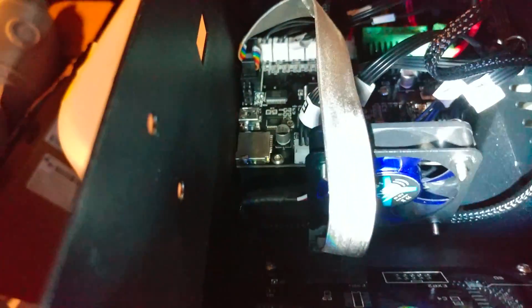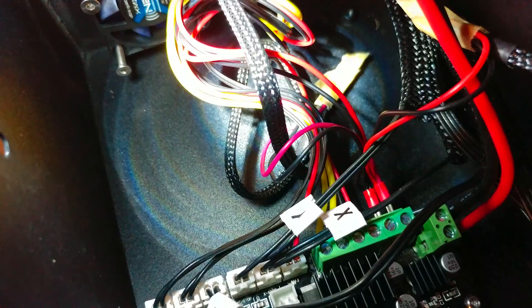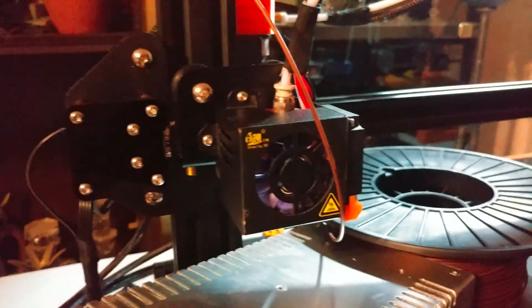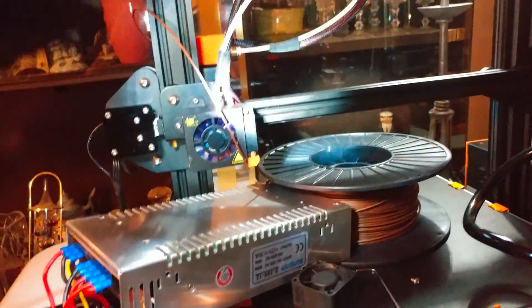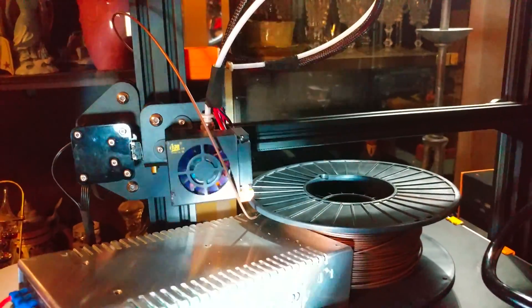To recap: there's the 40 by 40 by 10 — you should use a 40 by 40 by 20 to keep it exact. This is the 50 millimeter by 10 using the existing mount, with the cable spliced in right there. Here's the terminal block with all the wires going to it; those two little red caps are the fans. In theory you could unscrew those and replace the wires if you damage them. But be very careful with the hardwired fan since that cable runs all the way through — you really don't want to cut off too much.